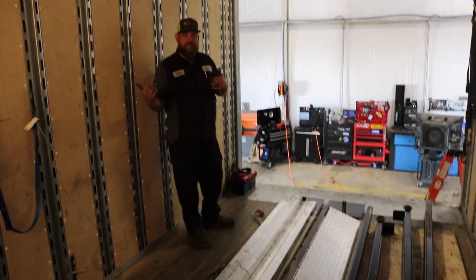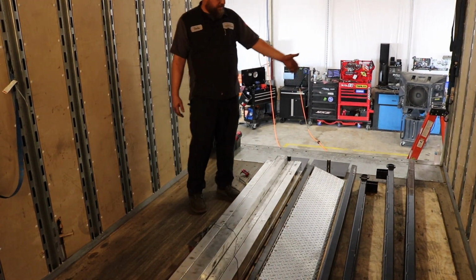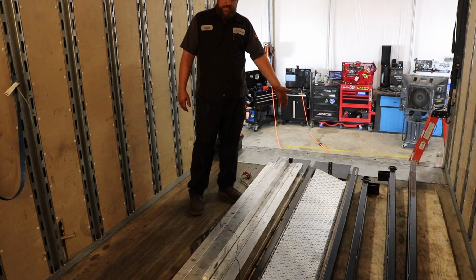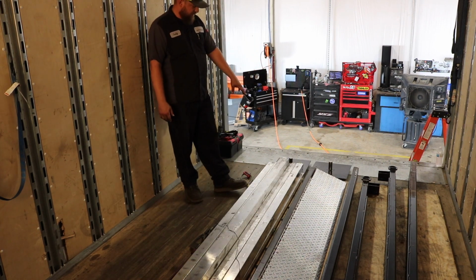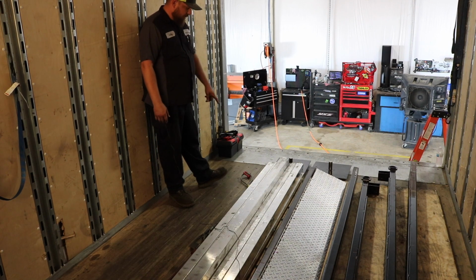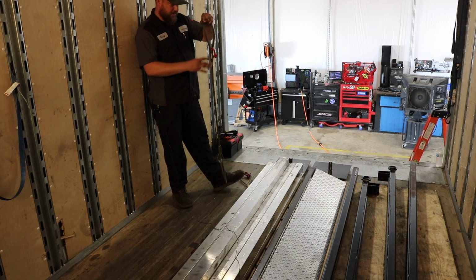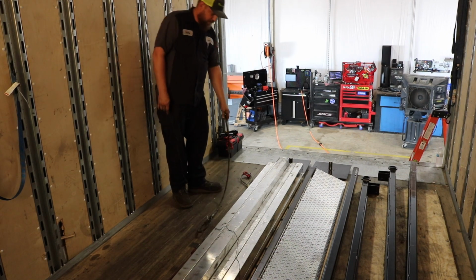If it is under your belly box, this is the equipment that you'll gather out. There's 5 steel beams, there is 11 load bars, 2 plates, and a small toolbox. Also, you'll find some cables and shackles. We'll get to those in a little bit.